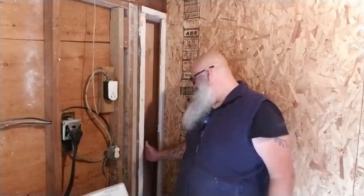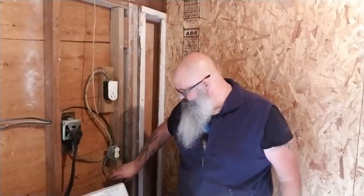So next, what I really should do is use the staples, big large staples, and staple these wires to the studs. But I forgot to bring some, and he doesn't have any here. And we've got bridge construction going on right now, and it's too much of a hassle to go back. I already forgot my drill bit, so I had to go back to get that. I should have thought about the staples before. So anyways, I'm gonna close it up as soon as I turn on the breaker, see if the power works.